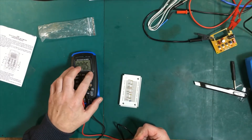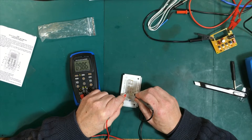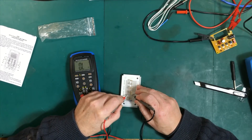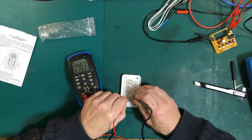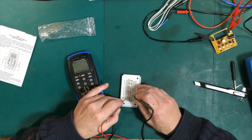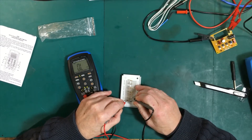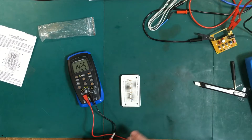Let's take the next step up. We get 9.86 — that should be 9.91. So in the higher ohm ranges there's about a 1% error. At the 100k range: 98.916. That's actually pretty good. We read 1.021 versus the reference 1.025. It's settled at 1.021 — not too bad; it's in the middle ranges, just a tad out. This one is supposed to be 9.929 and we've got 9.929 — right on. Not too bad.